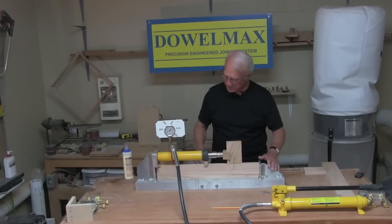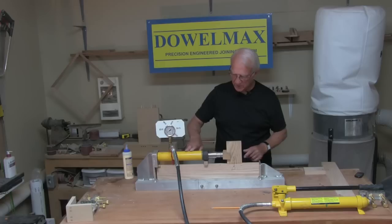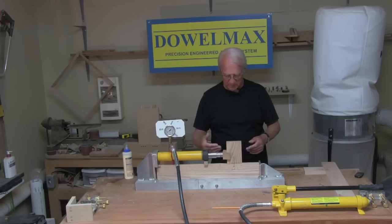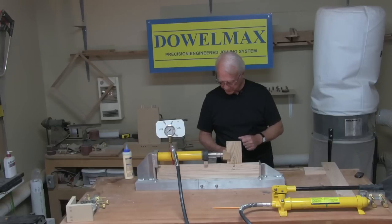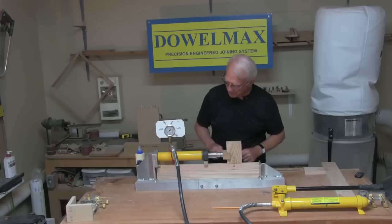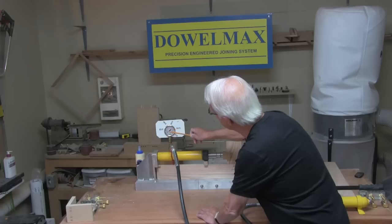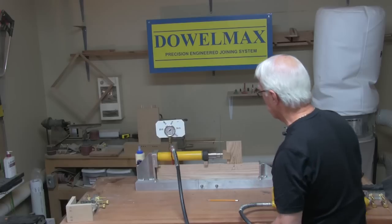The pieces are now ready. This is a simple hydraulic test rig I designed about 15 years ago. Its purpose is twofold: this is a 10-ton hydraulic jack, hand operated, intended to provide pressure in one direction. We get a shear force and also an extraction force which tends to pull the dowels or the Dominos out. I'm going to do the Domino first. Both pieces have been cured for 48 hours and both were done using Titebond II — everything is identical as far as we could make it. The gauge lines show 200, 400, 600, 800, and 1000 pounds.